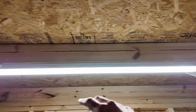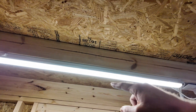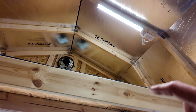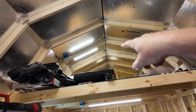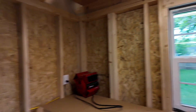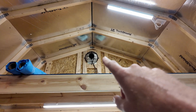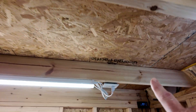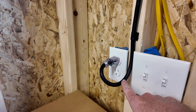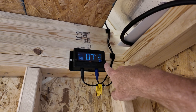The lights are on a switchable circuit. They're LED, quite efficient, and I can power them off right here. I got these at Lowe's — they were fairly inexpensive. Up in the ceiling I have a few smaller lights mounted just to light up the loft area and provide some light in here. With all the lights on there's actually plenty of light. Way up there there's a gable-in fan that is an exhaust fan — I got that off Amazon and it is powered by this outlet. It is controlled via this control panel, which allows you to set a temperature at which the fan will come on.